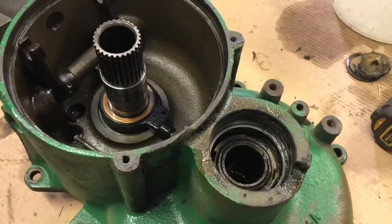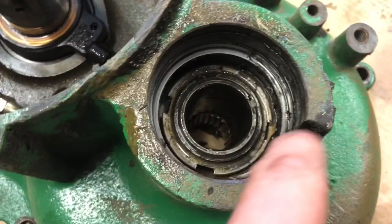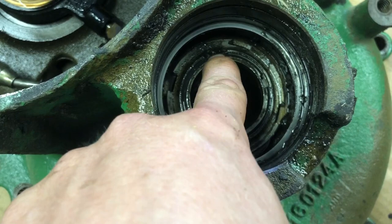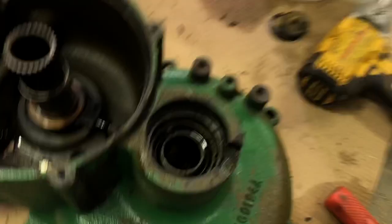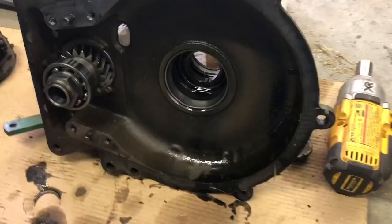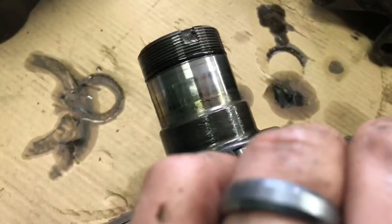All right, guys — the spanner nut is moving. I'm just using basically a punch and a hammer to drive it around. It's not boogering it up too bad, I don't think. One thing I want to note is this boogered-up spot on the spanner nut was right here in this notch of this shaft, and it's just under flush. I'm going to try to put it back in the same spot I got it from, because I don't know the correct procedure for how tight it needs to be. So I'm going to tap down on this with just the butt of my hammer so I'm not damaging anything. She came out. Once it came out enough, that shaft moves enough to go right around this bearing here. There's actually an O-ring right here, and there's a tapered bearing — there's the cone and there's the cup. The bearing is perfectly fine, so I'm not even going to mess with changing the bearing.